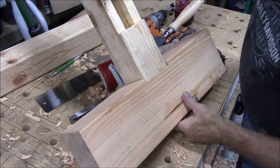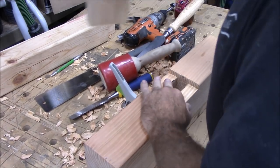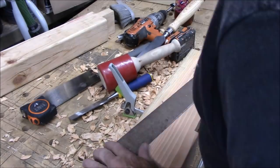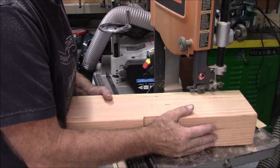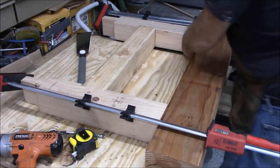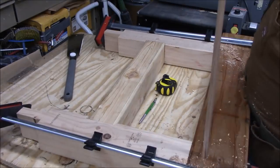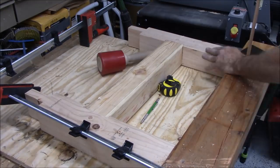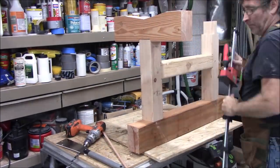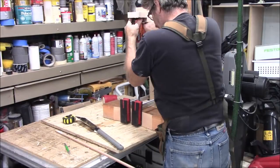There you can see the MFT moving around. That would be one of the feet — just checking my joint. Pretty happy with how they all came out and how solid they are. After I get the foot like that, I laid out a little taper and cut that on the band saw, so it would have four feet rather than a flat bottom. Then using the clamps — I didn't film more of this, I didn't think it was necessary — I clamped them pretty tight, undersized the holes just a little bit, and drove in some regular dowels.